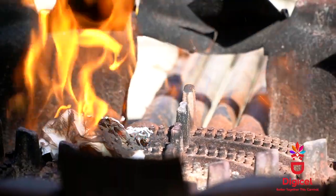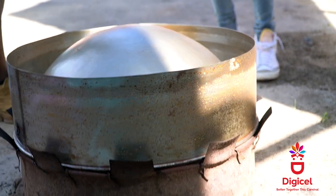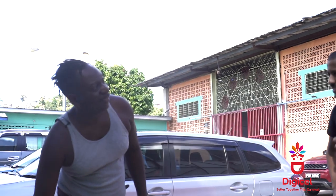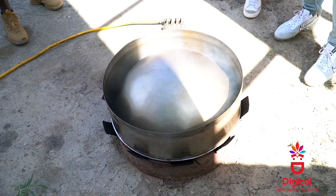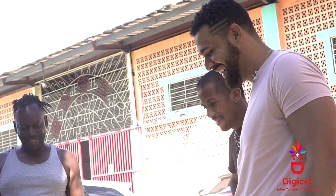Well, burning the pan. When the pan is made, the maker takes that pan from a natural state. The drum is flat like that. And when you sink it and you do all that grooving and stuff like that, you put a lot of stress on the pan. So this is a scientific thing we're doing here now called stress relieving. I do that in engineering, we learn that. In metallurgy, yeah. So we're doing stress relieving. So right now we go curry in the pan.